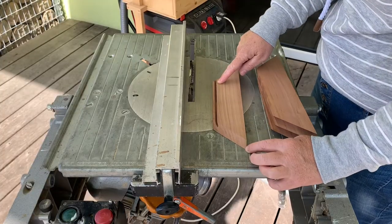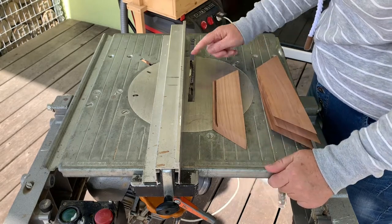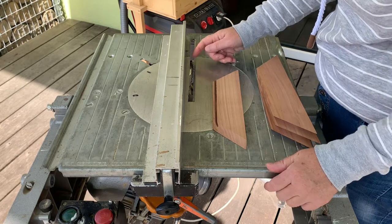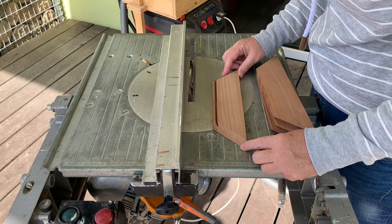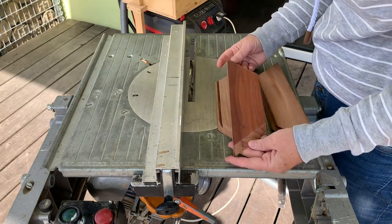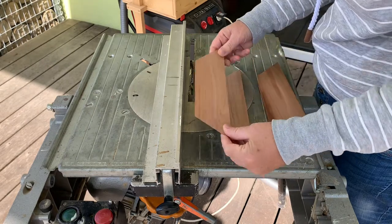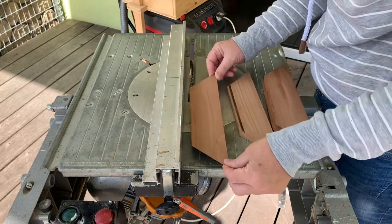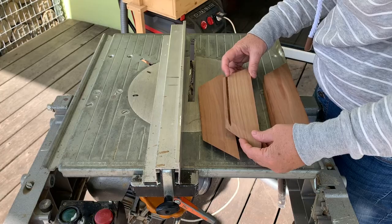I'm going to make now this groove. We've turned the table saw upside down and put the saw at a 30 degree angle. Everything we use for this project you can see down below in the description. Then we're going to take a piece of wood that we've already cut that's oiled — the oiling goes underneath. We're going to go twice over the saw so that we get a wide enough groove to fit the base in.